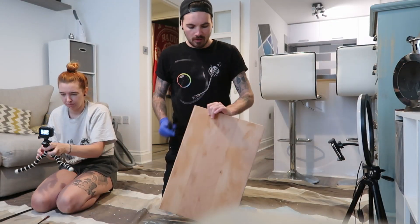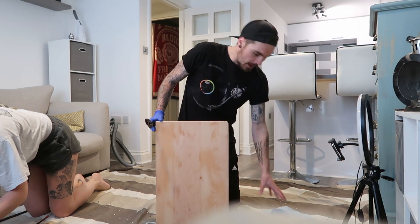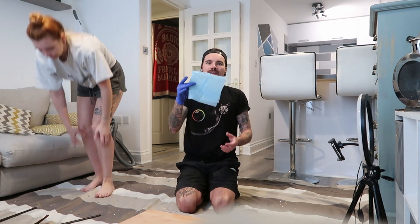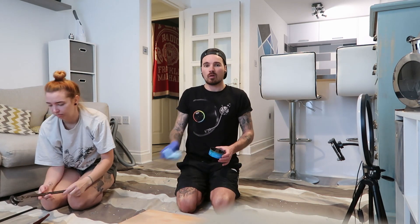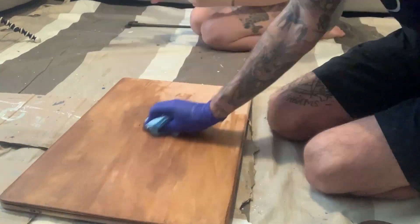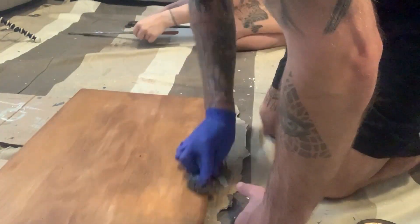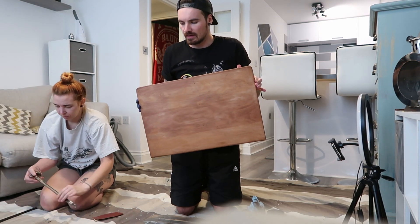This has been sanded down, now I'm going to start waxing it. We've got some antique brown wax and we'll probably do about three coats on the front and back. While I'm doing this, Chantal is going to sand down the hinges, give them a good clean, and then we can take them outside to spray them. For the wax I'm just using an all-purpose lint-free cloth — you can use any lint-free cloth for waxing. I'm just going to rub a light layer on, then rub it off and buff it. That's one coat done; we're going to do three, so we'll leave it to dry a little bit before the second and third coat.